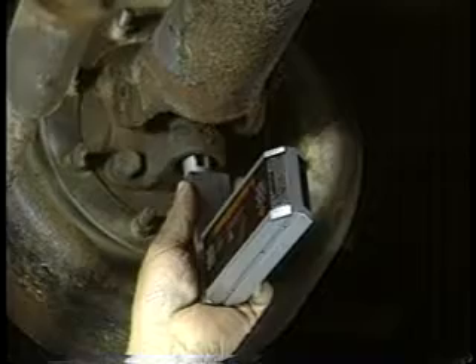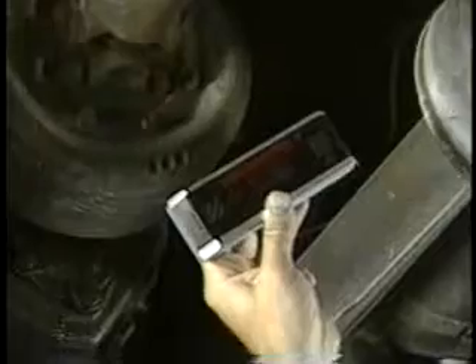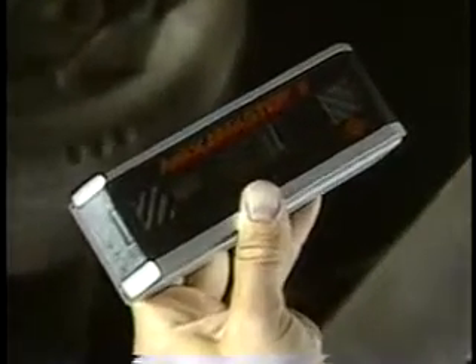In this application, remove the snap rings from the universal joint and take your reading directly off the cap utilizing an Angle Master adapter. This slope measures four degrees down. The next slope we must have is the center line of the coupling shaft, measured directly off the tube. This slope measures seven degrees down.